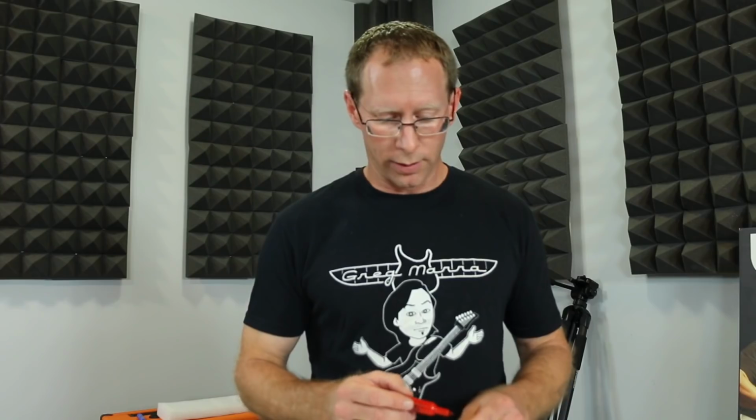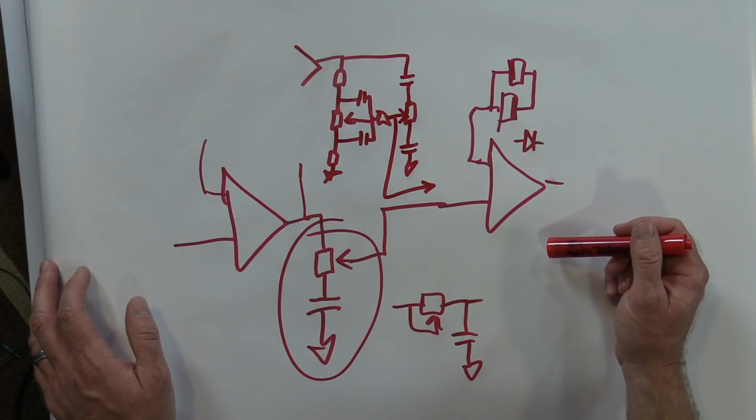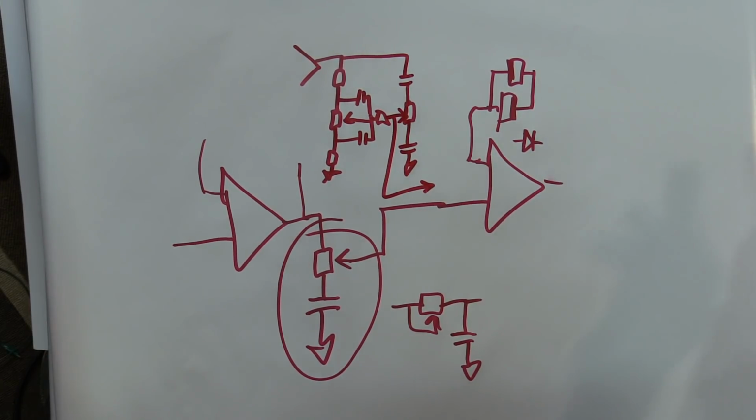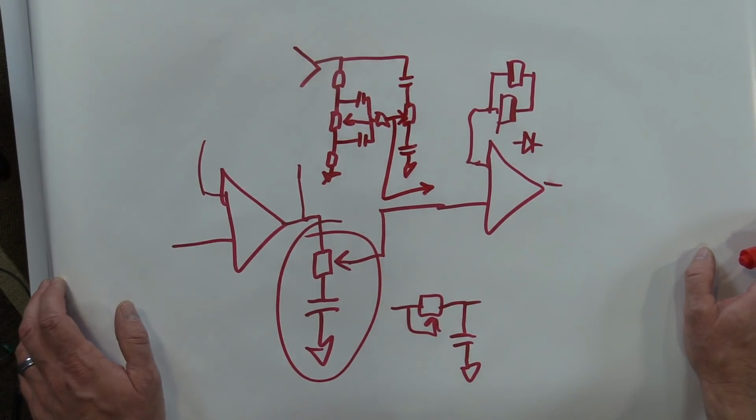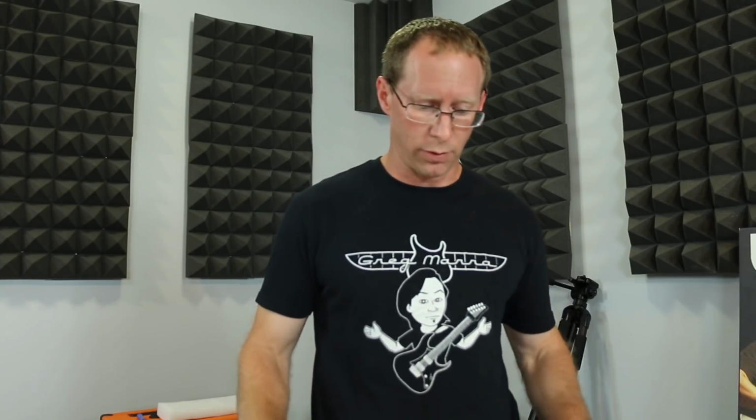From that point, it's not really a tube screamer, because what we call the tube screamer is just simply two different gain stages with the cool tone control. Everything else is like run-of-the-mill stuff that has been done for years and years and years. How do you do a simple low-pass filter, like what you have after the normal stage on a tube screamer? It's very simple.